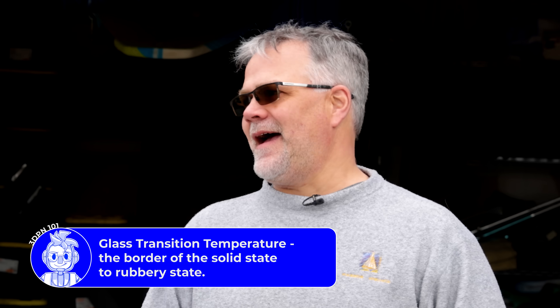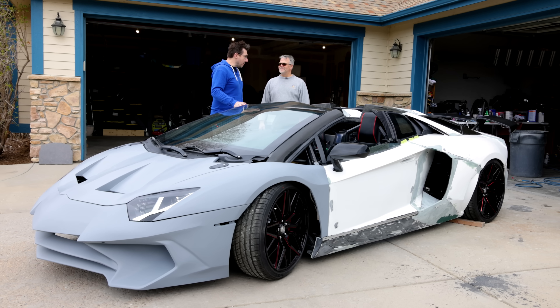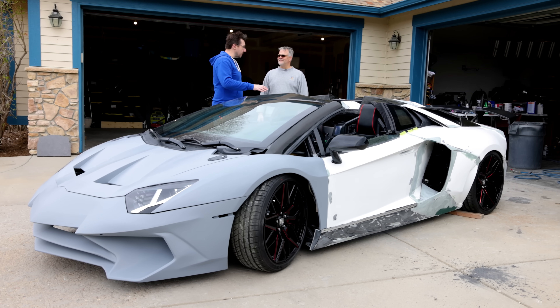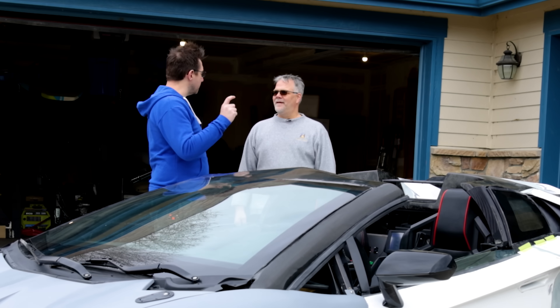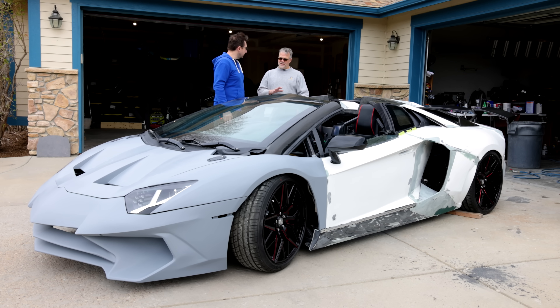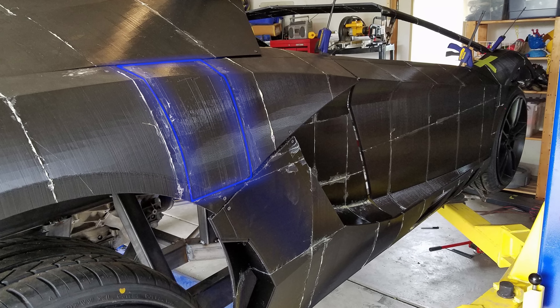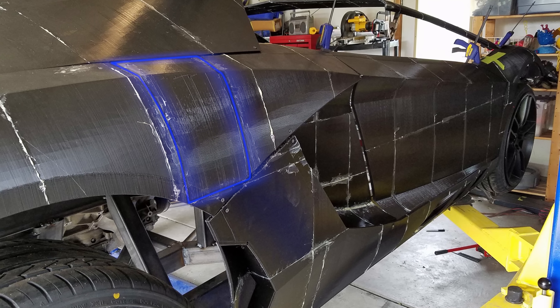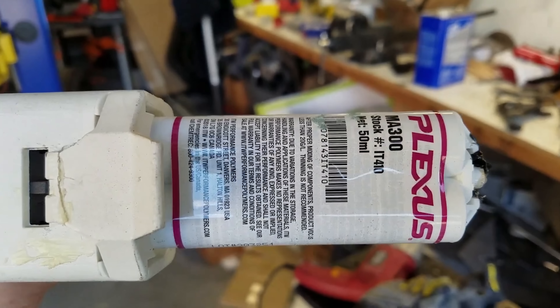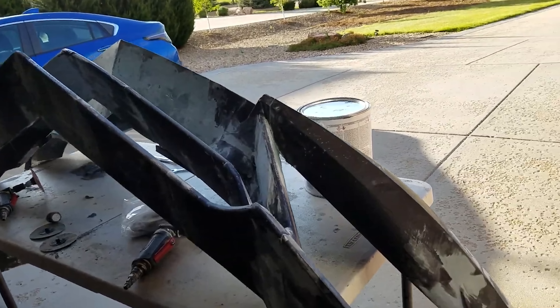The glass transition temperature of PLA is not that great, so having it exposed in the sun is not good, and plus it's not very structurally sound. The body is printed using the same material I make little articulated dragons out of — with a twist. It is laminated, actually encapsulated in carbon fiber. We would make small pieces, about a foot cubed depending upon the shape of the piece. Then we use PMMA epoxy to butt-join all of those together into a single panel.